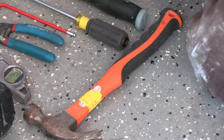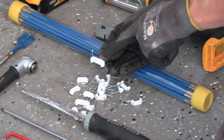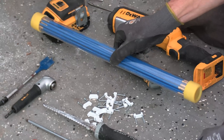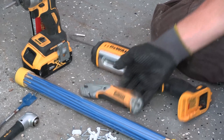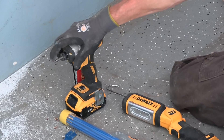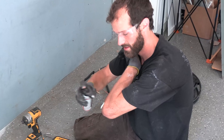Insulated fiberglass hammer. Klein keyhole saw. Staples — forgot to put those in the materials list. You can use a three-quarter inch staple or a number six SER staple. Fish sticks — could substitute fish tape. Utility knife for wire stripping as well; a sharp blade makes all the difference. An impact with a number two Phillips for mounting the box and receptacle. And of course, a little good old-fashioned elbow grease.